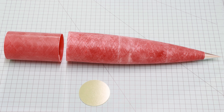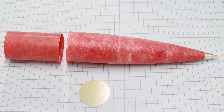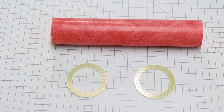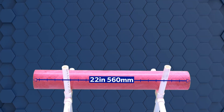Let's start by looking at the components. We have a 5-inch coupler, a 14.5-inch nose cone, and one bulk plate. For the electronics bay, we have a 1-inch switchband and a 7-inch bay followed by two stepped av-bay closures. For the motor, we have a 54-millimeter by 11-inch motor mount tube and two 54-millimeter to 75-millimeter centering rings.